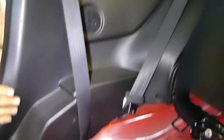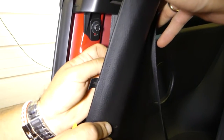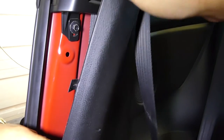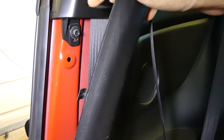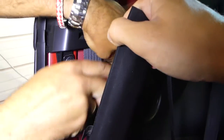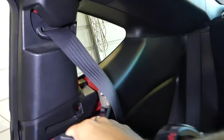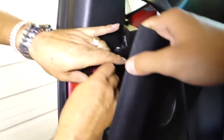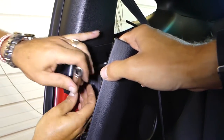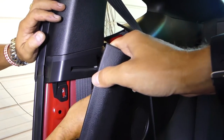It's a pretty small car. One clip came off — you just pull it out and push it back in. Now we have two 10mm bolts to remove: one there and one right next to it. You can see there's enough room to do that without taking too many things apart. Once they're loose they usually go by hand, so it's not too complicated.